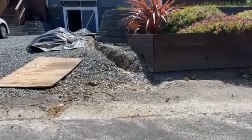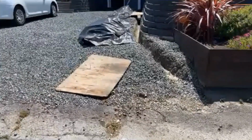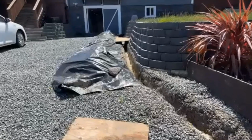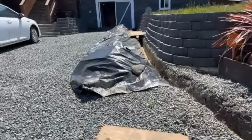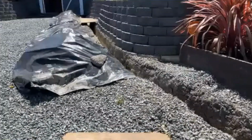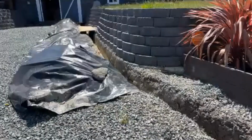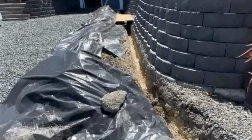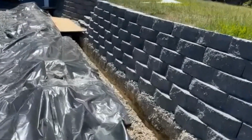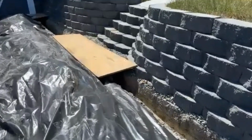She asked me, where does the solid pipe go? From that T at the wall, that's going to be solid pipe. That's where she'll connect the solid pipe, because we've collected the water and now we want to discharge that water. So this becomes 4-inch solid pipe out here to the front. She could use a pop-up, but better would just be to cut that off at an angle and leave it an open drain, because if you use the pop-up, it's going to turn and you lose a couple of inches of fall. And she needs as much fall as possible away from the area.